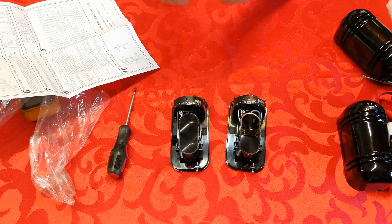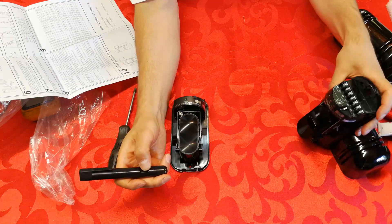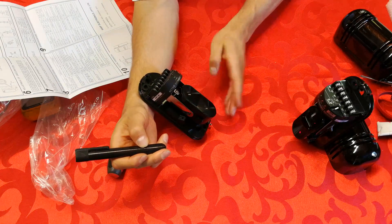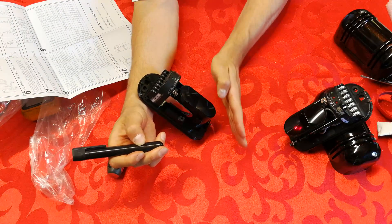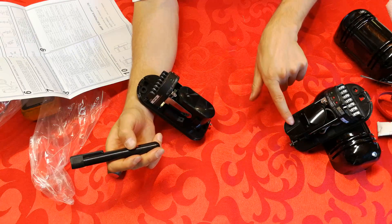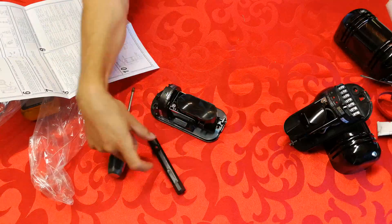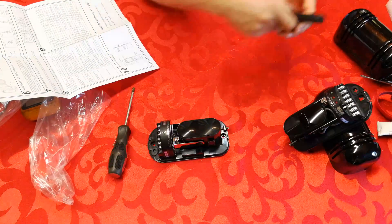I'm using a laser pointer to demonstrate the principle of operation. The sender sends the infrared — it's not a laser, just giving an example. When somebody walks in front of it, it breaks the infrared signal. That's why it's called a dual beam — you can also get quad, six, and eight beam versions, or strip beams. Only once both beams are broken will it initiate the trip.